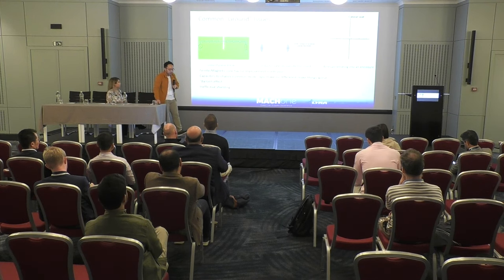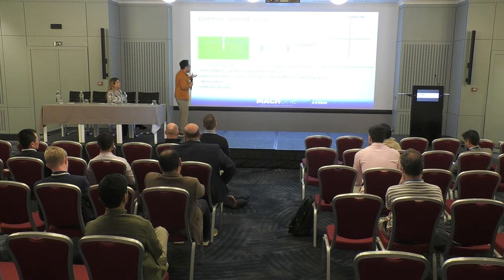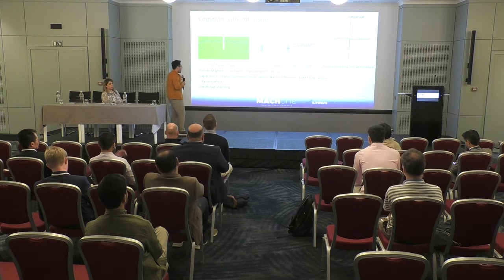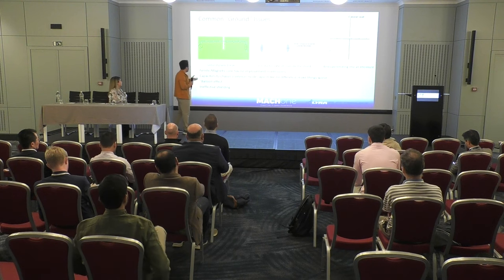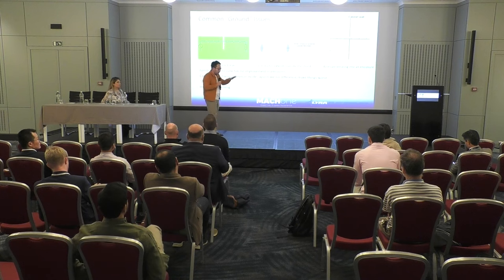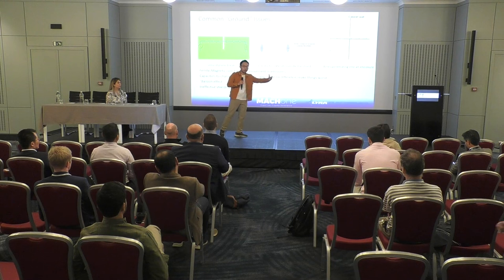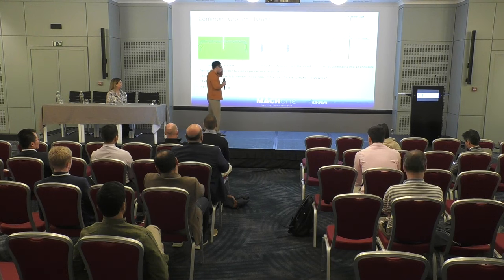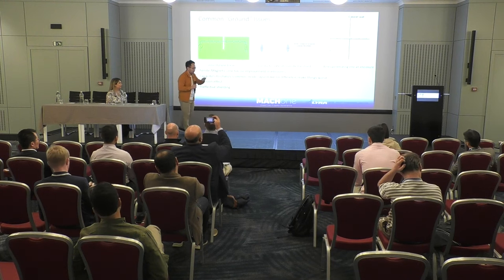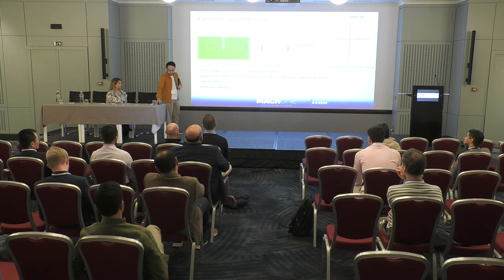So here I list a few commonly seen issues that are often related to ground. As we mentioned, one phenomenon we often discuss in the EMI/EMC society is the balloon effect, meaning you try to suppress noise at a certain frequency. Yes, you suppress it, but then at a higher frequency, something pops up again. Almost as if you are trying to push a balloon down and then the other one is coming up.